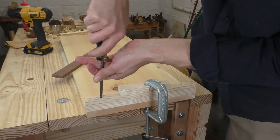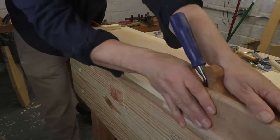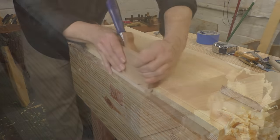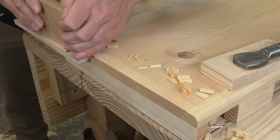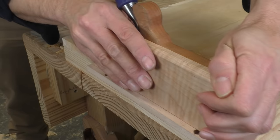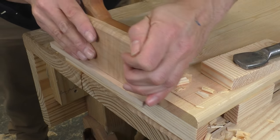Now the lid should stay flat, but it's much too plain the way it is. Historically, even simple chests had molding around the trim. My favorite molding profile is the classic thumbnail shape, mostly because you can cut it without any special tools — it's just a shallow rabbet along the edge, and then you round over the corner with a smoothing plane. Carrying the profile around the corners is challenging because suddenly you're going cross-grain, but if you pre-cut your lines and bevel the end grain, you shouldn't have any problems. Lots of people cut the ends first, so any mess-ups will get cut away when they do the long edge — honestly, I should have done it that way, but I forgot.